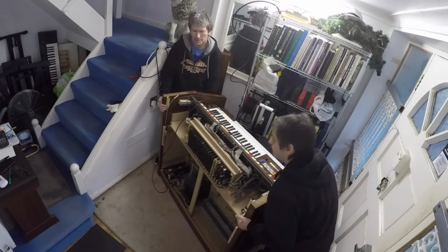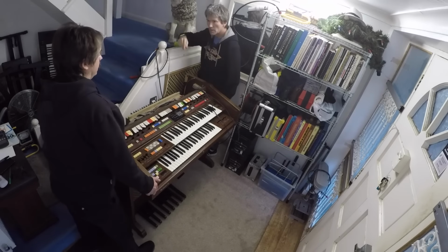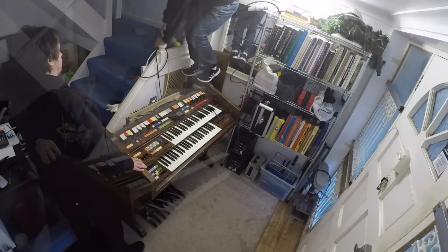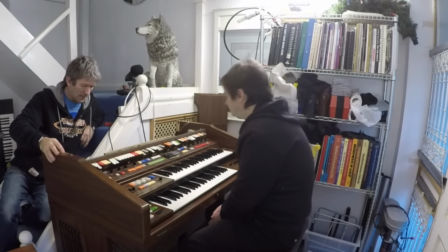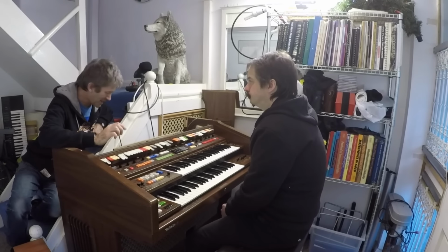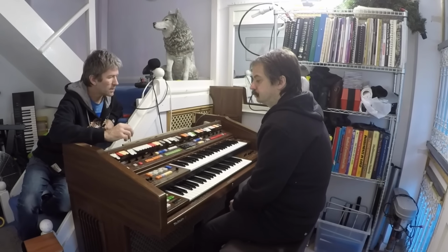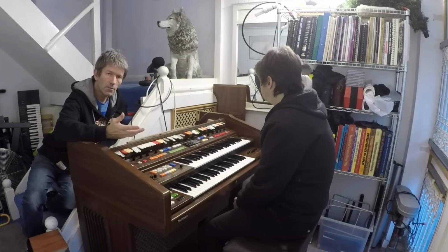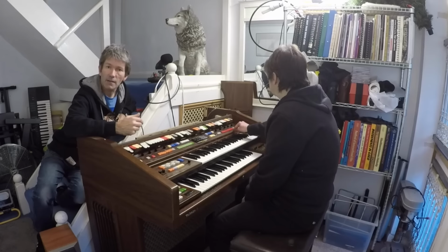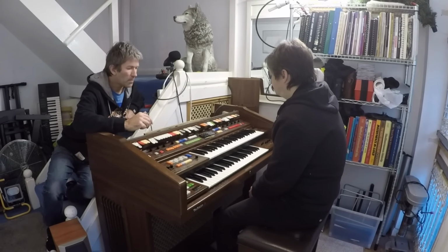So all I've done now is connect that speaker up to those two wires that were just flapping about in the breeze, as Dave on the EV blog would say. And yes, we've already had a little play and it kind of works. So the amplifier is okay, brilliant. Obviously what's happened is that the speaker may have ripped its cone or blown some other way, and somebody's taken it out to repair it and it never got replaced again. So that's why the bass pedals aren't playing properly.